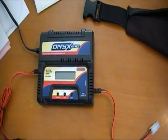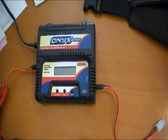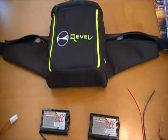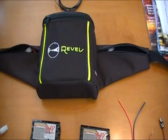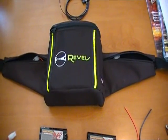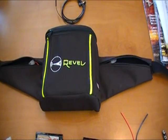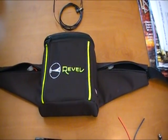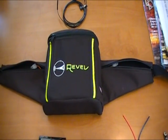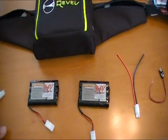Here's a charger. I bought this at Gizmo's Hobby store in Burbank — it's actually a pretty high-tech charger. These batteries will charge up in about 15 minutes, and if you do this modification to your Revel you'll notice about a 50% power increase, so it'll be much louder. If you're street preaching or whatever you're using the Revel for, it'll last many hours. I usually only charge this about once a week and I probably go out several times a week. The calculation I've done shows it lasts about 10 to 20 times longer than a 9 volt battery.